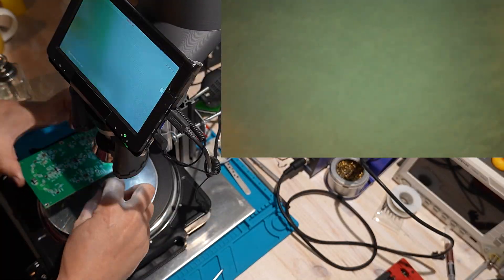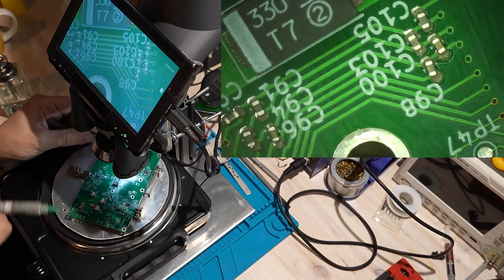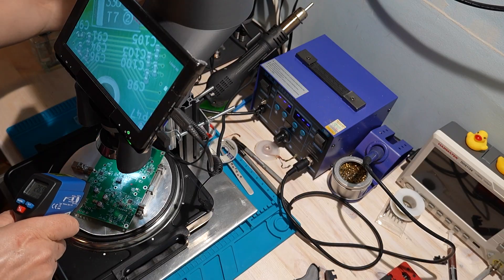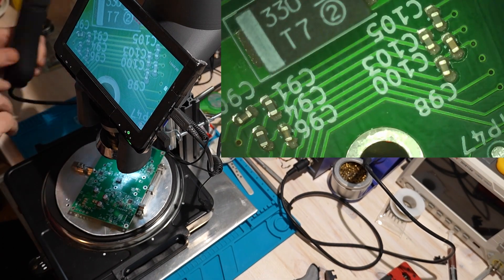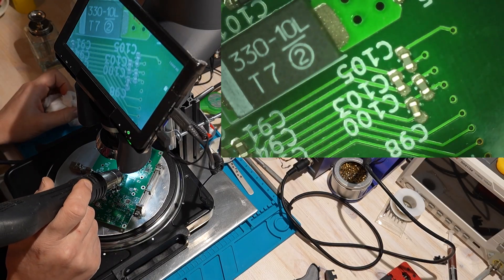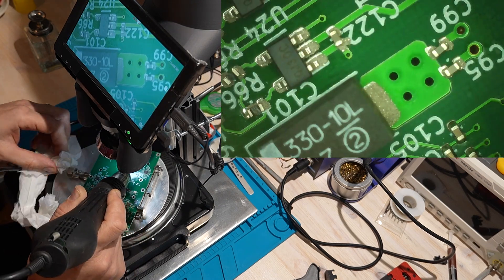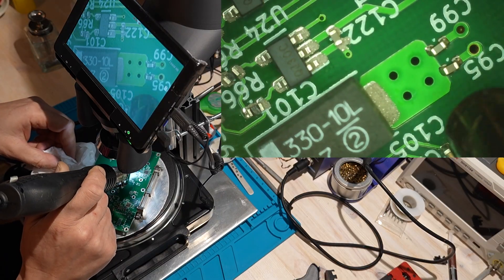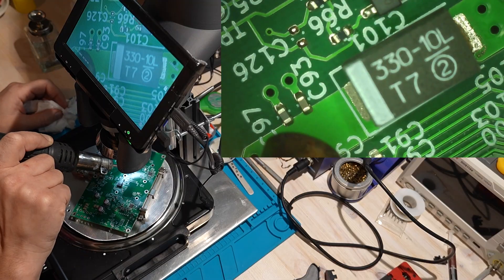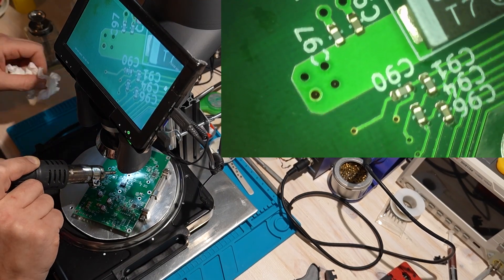Now I'm setting the cooking plate and letting the PCB warm up first. I'm checking the temperature with the laser thermometer — you have to aim at a dark, non-reflective area, otherwise you'll get the wrong reading. I changed my PCB holder setup: I removed the PCB holding jig from its housing and mounted it onto a 2mm aluminum sheet using tapped M3 screws, then used M4 screws as legs on the other side. This gives a small gap between the cooking plate and my homemade aluminum jig so the heat spreads more evenly, and the PCB is held firmly in place.